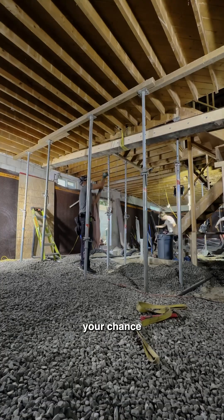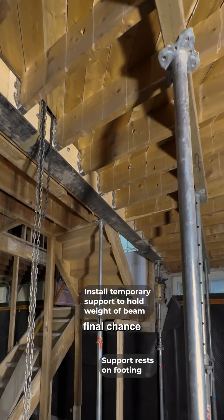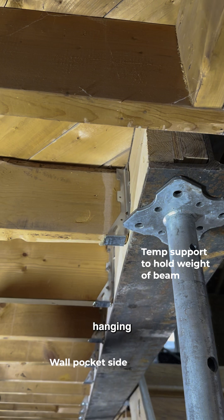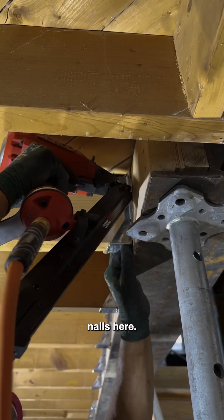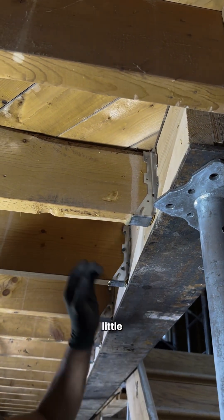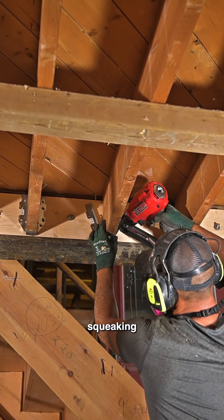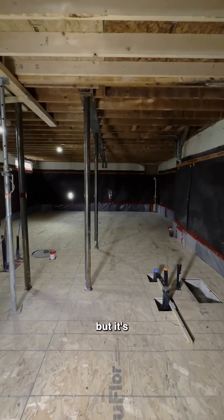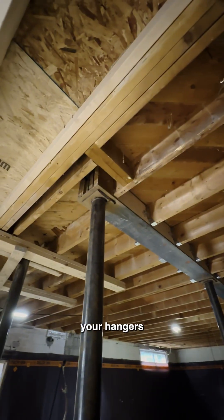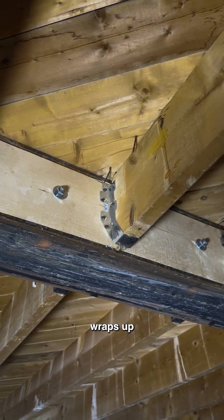Level off everything - this is your final chance to level the framing system and subfloor before you start hangering. Once the beam and subfloor are level, we start hanging the joists using inch-and-a-half metal connector nails. I put a dab of construction adhesive PL at the bottom of each hanger to prevent squeaking from any shrinkage later - typically done with new joists. Shoot your hangers in, put your columns in on either end, and that basically wraps up a flush beam.